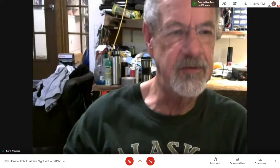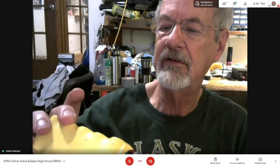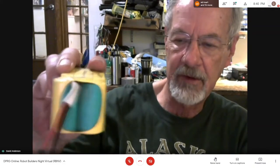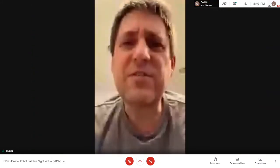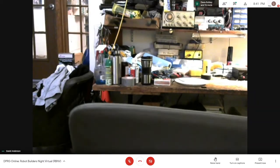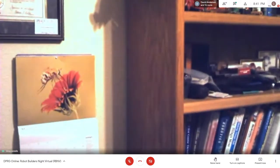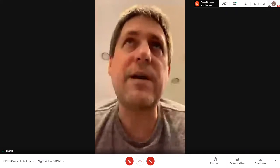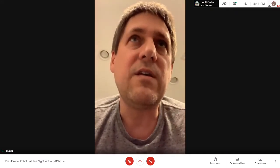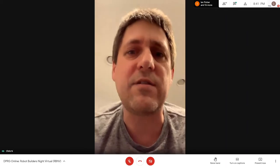Yeah, Chris, I don't know if you already moved past this, but this is a 10-cell pack of those mini nickel metal hydride, 5,000 milliamp hour sub C cells, slightly smaller than a C cell. Well, it looks bigger, maybe just because they are arranged differently. See if I have a ruler. Yeah, the Neato batteries were never that big, right? They were smaller than the Roomba batteries. Yeah, well, they had them in sets of 2, or at least originally. Like I said, the way this battery pack is laid out, they're not stacked side by side, but kind of 2 rows of 5 end to end.